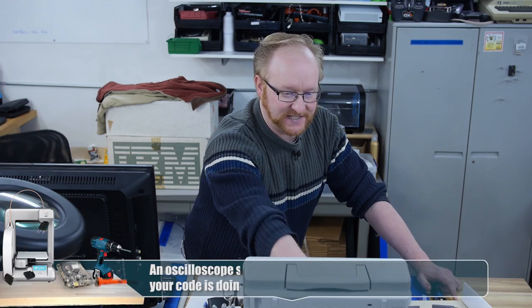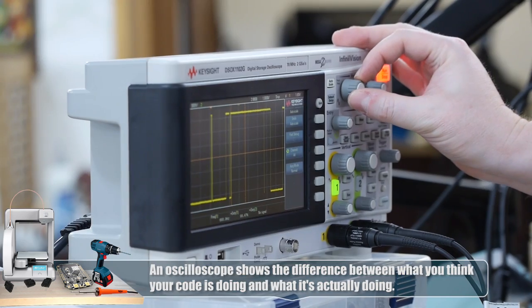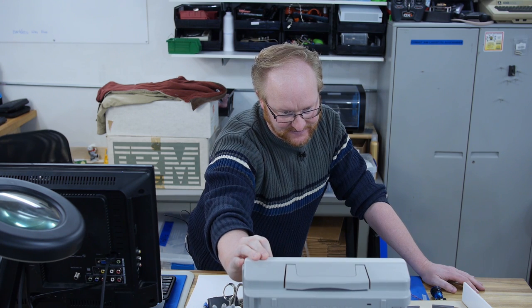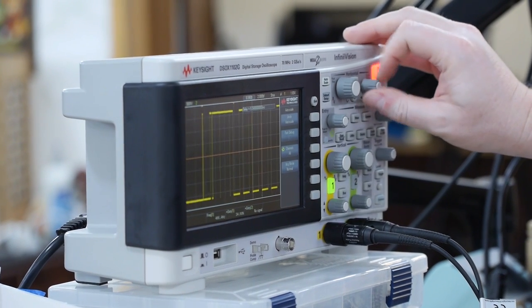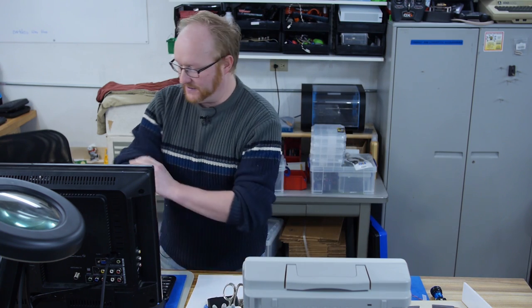So the switch is debouncing, that means it's not quite open, not quite closed, so you can see it on the scope. And then we have only a few cycles of solid power, and then we go into the hold power. Yeah, so blinking that LED to try to figure out the frequency is giving us an inaccurate rating. Because this is 488 hertz for the PWM, and then we have only about three cycles, so that's a very, very small amount.